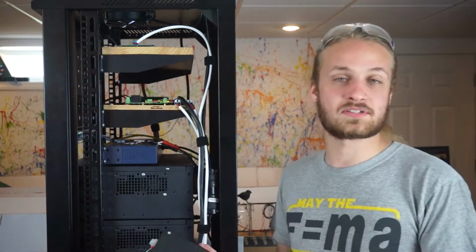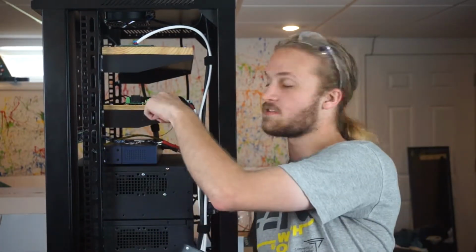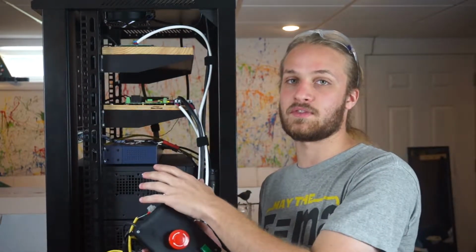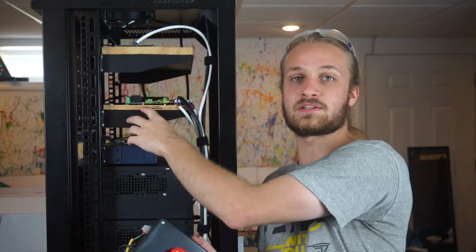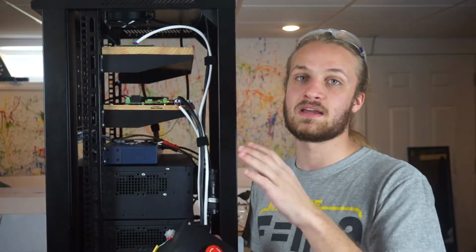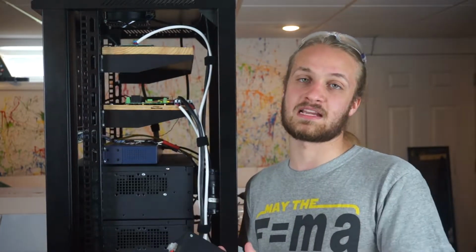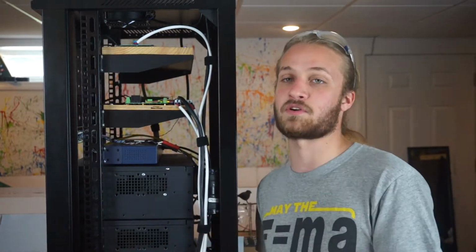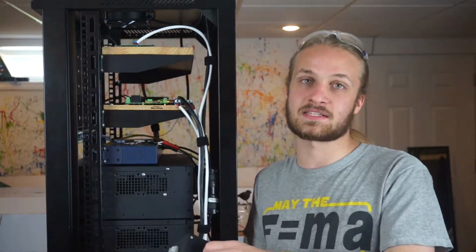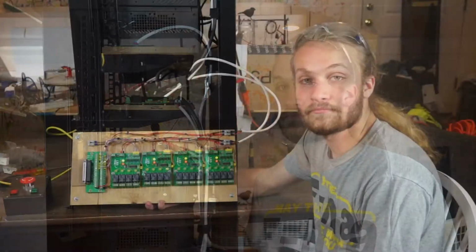And so this allows us sort of a hard shutoff. When we press this button, it turns off, you can see the red light here, that when we press the button, it turns off the power to the relays here, which in turn turns off the solenoid outputs, which allows us a real safe and fast and reliable way to turn off the valves in case anything goes wrong. We also have a software shutoff that runs a normal shutdown sequence, but this allows us, in case all else fails, we can at least turn the flow of our fuel off.